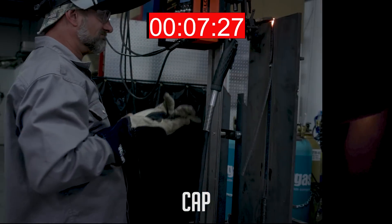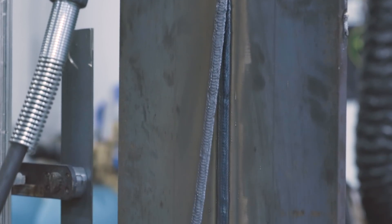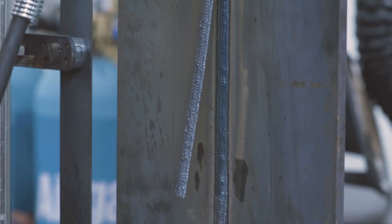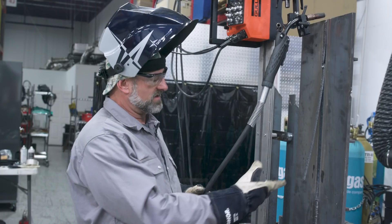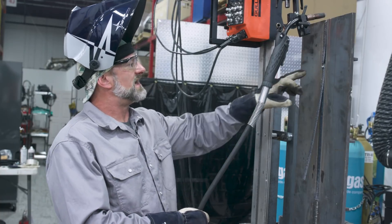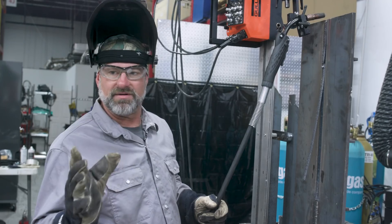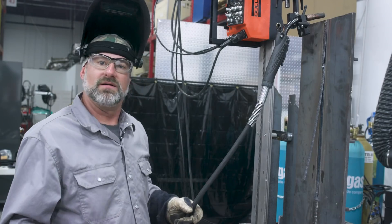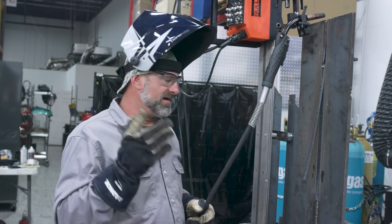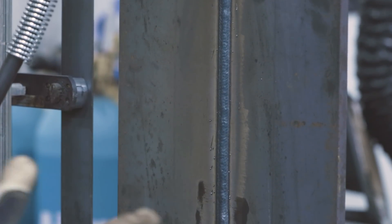Cut it. As you can tell, everything was on point — the travel speed was good, the wire feed was great, the heat was great because the flux peeled right off. Look at it, it's just hanging there. That's pretty slick. I had a little mishap up top — the BBs must have landed on the cup and built up right there. I can hit that with a grinder and visually fix that. I'm going to knock the slag off with my fingers. There it goes. That's what I like about this Bowler wire — the slag cools fast, which makes it easy to remove.